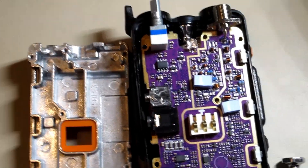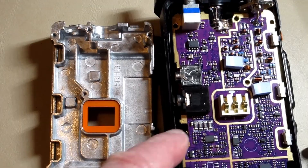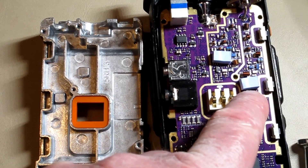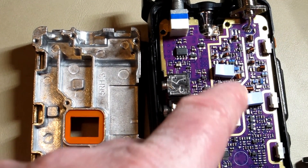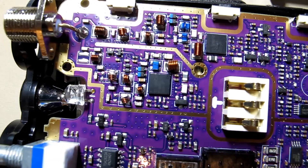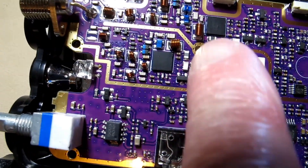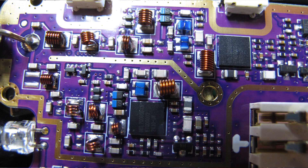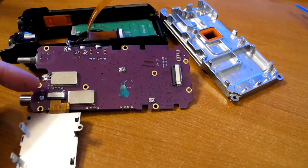The heat sink is all of this metal, plus there's some shielding. The power transistors must be under these little blocks of what look like foam, but are thermally conductive no doubt. Here's what's under the thermal conducting pads — these are the PAs here and here.